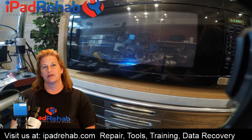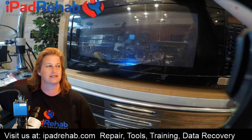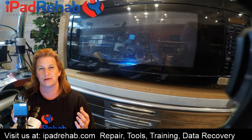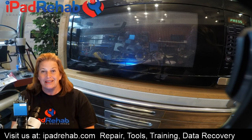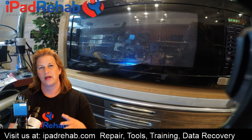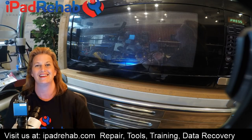One cool thing I found was from a site called Evil Mad Scientist — it talked about doing these experiments. If you look up how the microwave works, it has a magnetron inside that generates microwaves, and they stay trapped inside because it's a great big metal box. I learned that you can put a big sheet of metal in there, because only things like crinkly aluminum foil or really thin wire are not compatible — a big thick heavy piece of metal won't induce those electrical currents or arc.